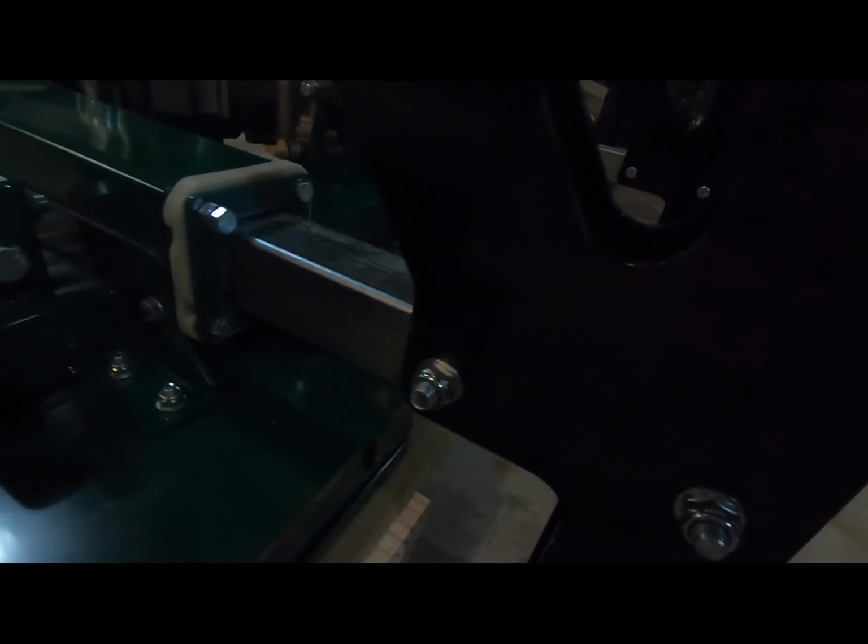One other thing I forgot to mention. Make sure that you put this head at least 6 inches off the ground, because you need clearance under here so you can get your bolt started in the frame. That was the other thing I forgot a minute ago.